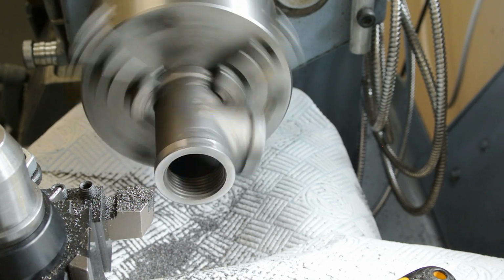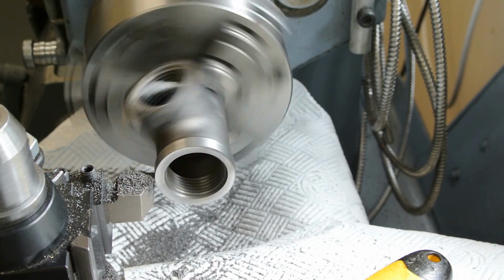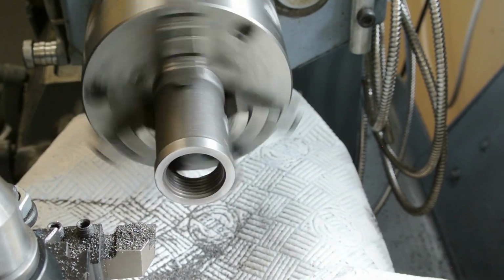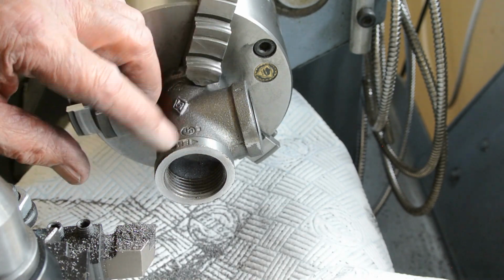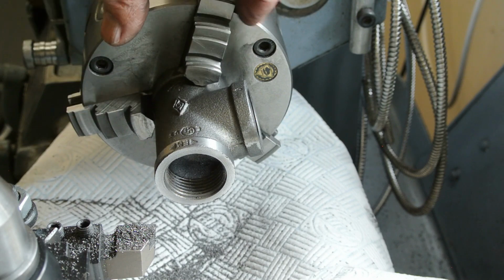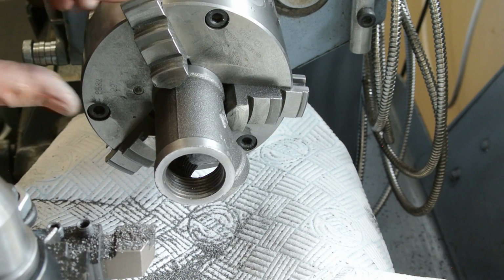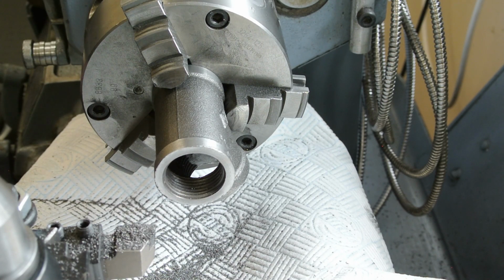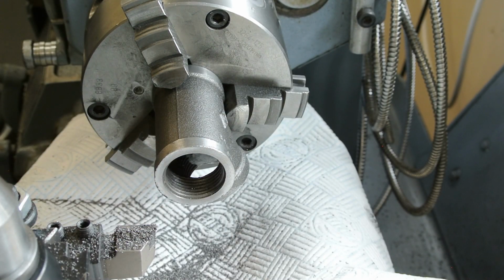Just a touch more and that's that end done. Right, that's that end, and there's just a little bit of unclean part there. It's a little bit low, but that's only a minor bit, and the rest of it's completely cleaned off. So there we go. That's cylindrical with that end, and the plane of that is the same plane as on this end, and I can now bore out the centre part.